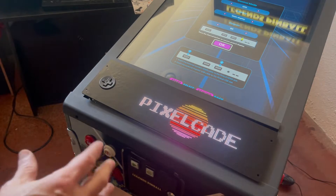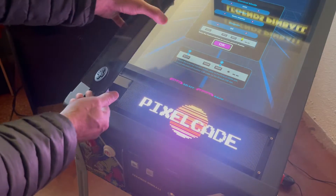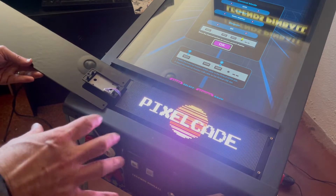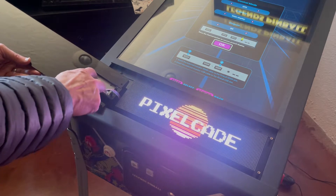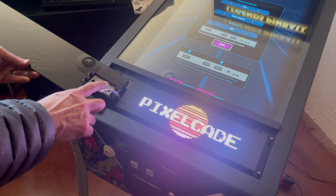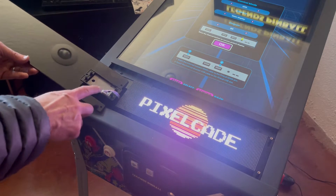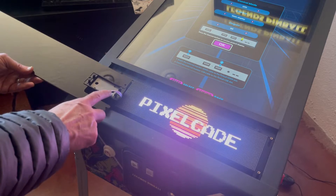I want to show you something really important. In the next part of the video I show you how to wire up that D-pad, but as I was filming I actually made a mistake and wired it upside down — I later fixed it, which I didn't show in the video. The correct orientation: in the video you'll see the connector in the upper left corner, but it should really be in the lower right corner. Don't make the same mistake — make sure it's this orientation, otherwise when you press up on the D-pad it will actually be down and vice versa.